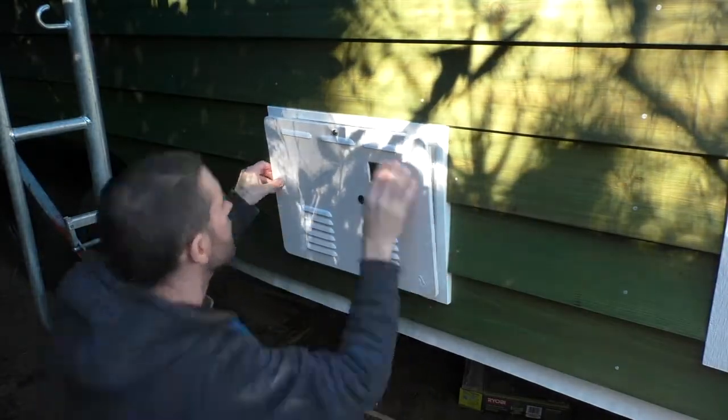I got a little more creative for the vents. I bought a single 2x10 board and cut the pieces out of that, making each trim piece one solid piece to the exact size I wanted. The trim's only purpose is to stand the vents off from the siding and to prevent any water from ever getting behind the wall caps.